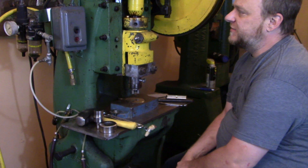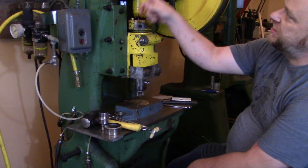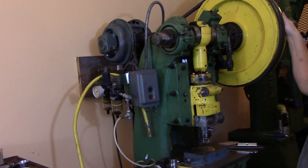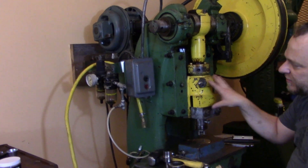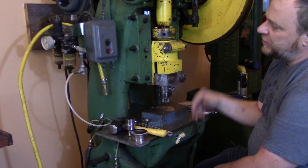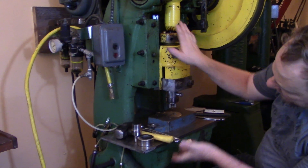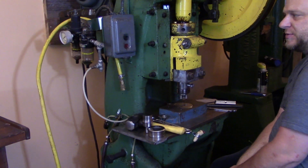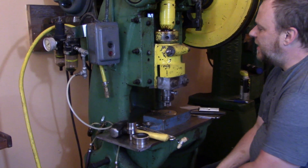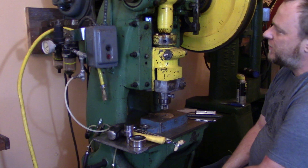There are lots of different types of punch presses out there. This is what's referred to as a crank press. You can see just from a crank, kind of like seeing a motor, it's just got a cammed crank up there. This type of crank press in particular — that's kind of a broad term — this is what's referred to as an OBI, which is an open back inclinable, which has an open back and the whole thing can tilt. It's probably about the most common crank press there is these days, but we don't utilize those functions. We just are after the crank itself.